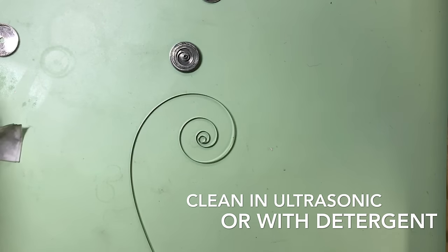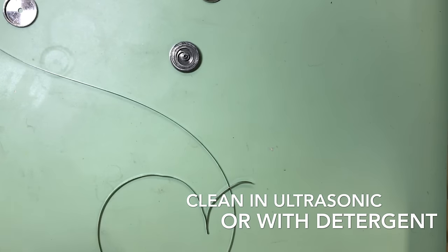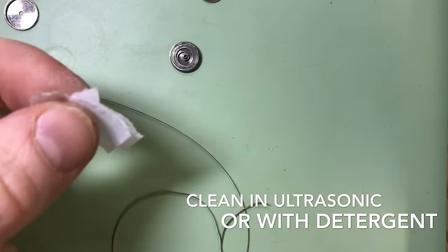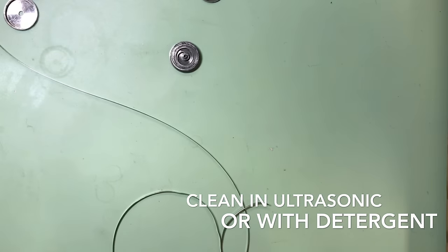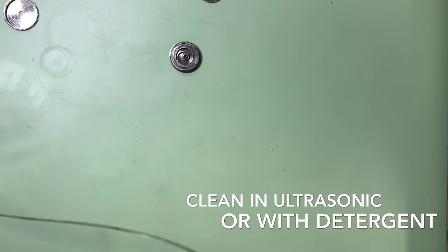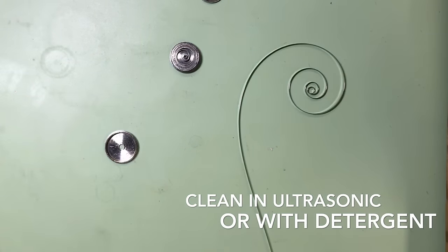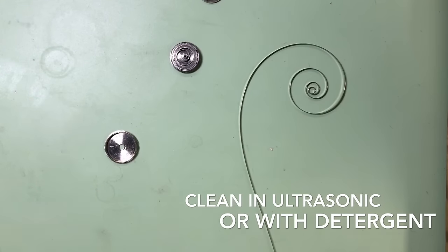The principle of this video is to show you how to take the mainspring out and put it back in. If you were to oil the mainspring, I'd recommend the same process — use a little piece of paper, dip it in your oil (I use Mobius 9010), and wipe it over. Alternatively, don't oil it beforehand; once it's wound in you can put some oil on top of the coils. Once the spring comes under tension the oil will move around and coat the entire spring.